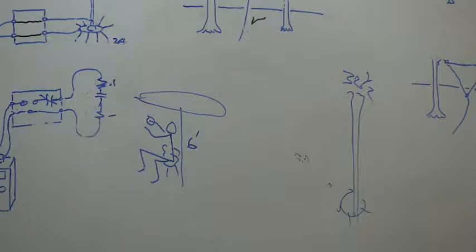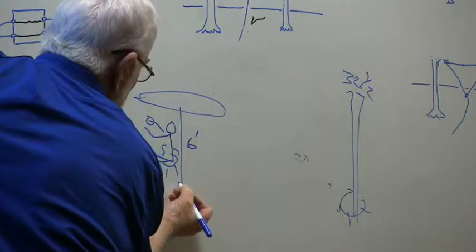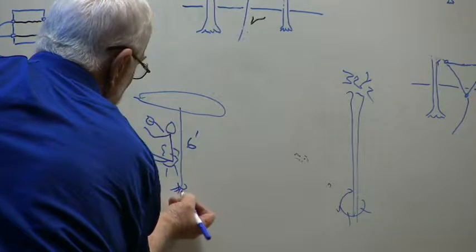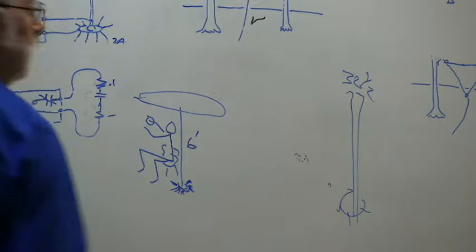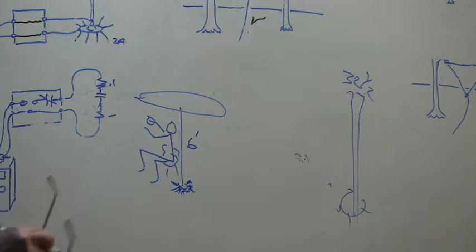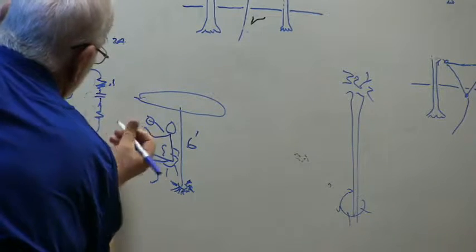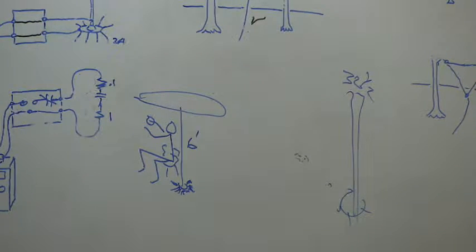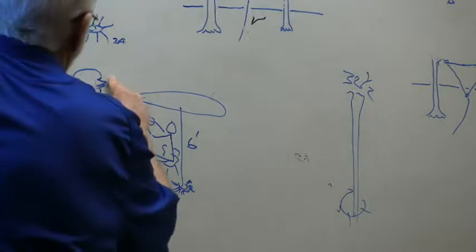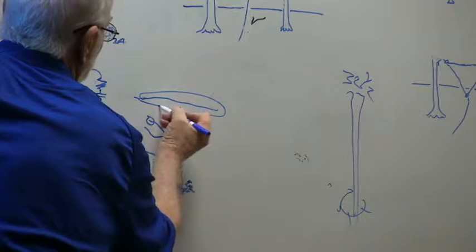And you wonder how that's possible. And here's how he did it. What you could see at the base of this thing was literally well over 100 radials going out 4/10 of a wavelength. So he was able to make the ground loss about 1 ohm. Put a lot of effort in. What he had here, you couldn't see beneath what looked like a beach umbrella.